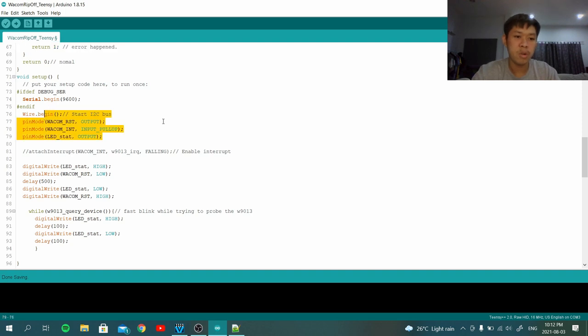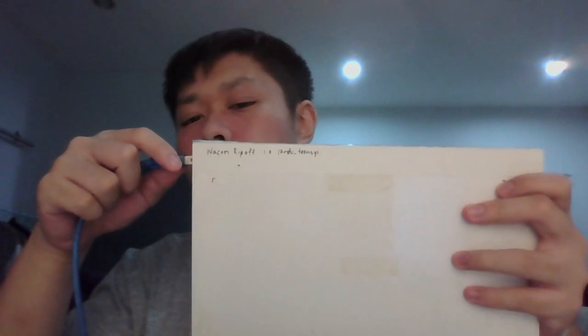So just I2C, define the pin, attach it up. The interrupt is no longer used as I said earlier. It seemed to get stuck in the IRQ handler. I could not fix that, so I just turned to polling. And this is just initialization of the LED. I haven't shown you yet that if I actually plug this thing in, there will be the LED shining right here. There's a little hole that I punched in.